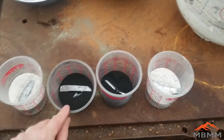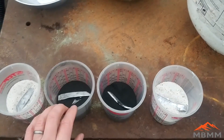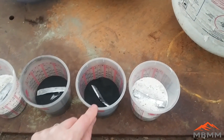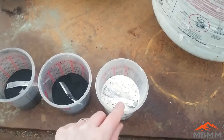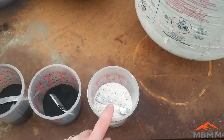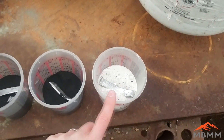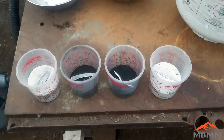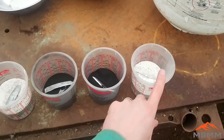This one is 250 grams of Chapman's flux with 75 grams of sulfides and 50 grams of lead. This one is 250 grams of Chapman's flux — I'm going to roast the sulfides, turn them into oxides — and there's also 50 grams of lead as a collector. And this one is 200 grams of soda ash, 50 grams of silica, 50 grams of lead, and 75 grams of sulfides, not roasted. To this one I'm going to add the iron rod. There are our four samples, and we're going to do them in this order: borax, Chapman's, roasted, and then the iron nail.